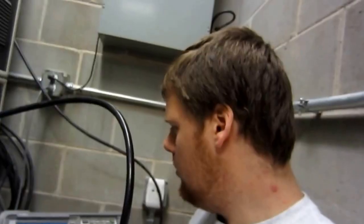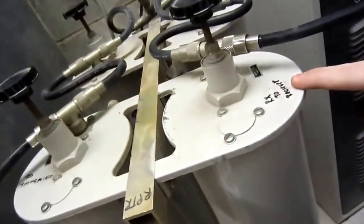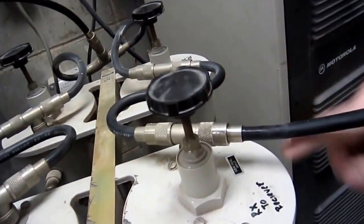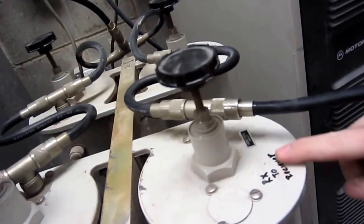It's best to have a dummy load with no reflective power at all, but it gives us a pretty good idea of the filter characteristics. The setup has the antenna jack in the back connected to RF out, and the input connected to the RX in of the duplexer — that's the receiver input. This tests the two cans which are the transmit-reject/RX-pass filters, and the transmitter side is connected to the 50-ohm dummy load.